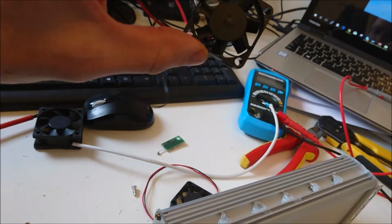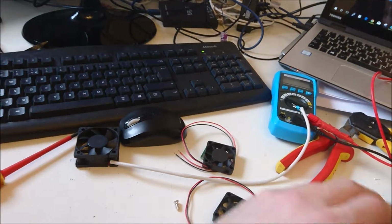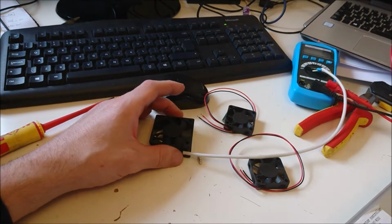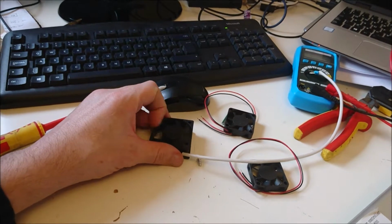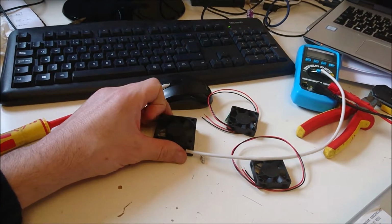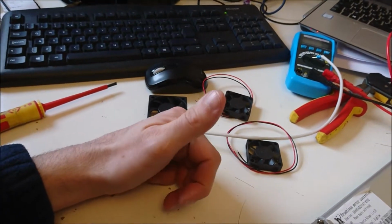For information, actually, I did a very, very similar thing on the regulator rectifier of my motorcycle. It's a Honda VFR 800, which are notorious for the reg-rex blowing, which indeed it did. So when I put the replacement rectifier on about 5 years ago, I added 2 of these small fans, and well, it hasn't blown since, but that doesn't necessarily mean it's because of the fans.